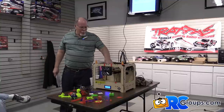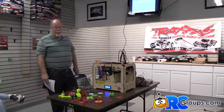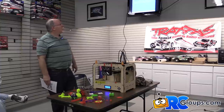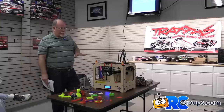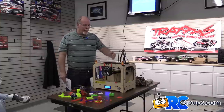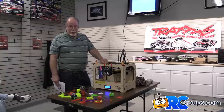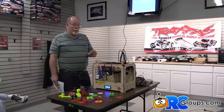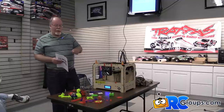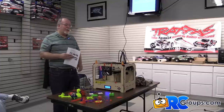The parts of the 3D printer: there's a device called the print bed, which is the platform where everything is built. Most of the time they're heated, sometimes unheated. With PLA you could do it without heat, but getting it to stick down is a problem depending on what material you're using. This one is heated — it's an aluminum plate with Kapton tape covering, which traditionally has been used for ABS but works with most PLAs. I also use blue painter's tape, which sticks really well. Some guys put down a glass plate covered with hairspray.